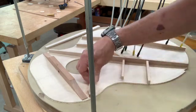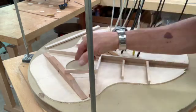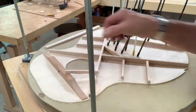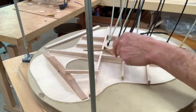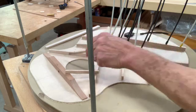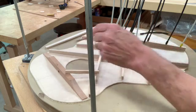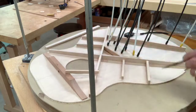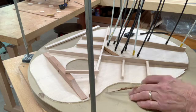And then I'll just cut in the angle and length needed for that sound hole brace here, and that'll go down. No sound hole brace is going on this side because we're going to put an LR Baggs Anthem system in there, and it needs space for the preamp and the control system. So I don't think it gets any more complicated than you've seen it right here.